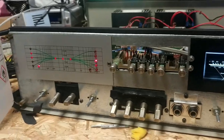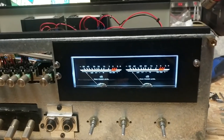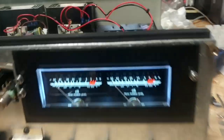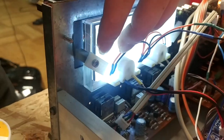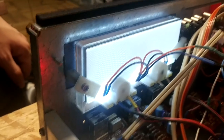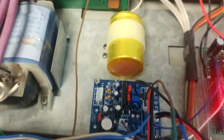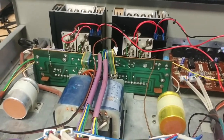Some time and some 3D printing later, the VU meter is installed. I've used M3 screws to mount the entire thing to the case of the stereo, so I don't glue anything down and can remove it easily. I had to replace one screw with a longer one, but that's pretty much it. The VU meter itself is also screwed on from the back — I used threaded inserts that you hot-melt into the plastic so you have actual metal threads, and that looks really nice. All that's left is to hook the VU meter driver up to the preamp of the stereo.